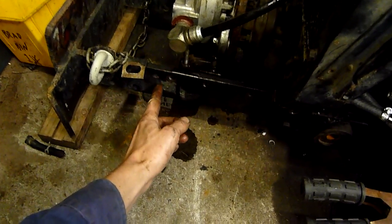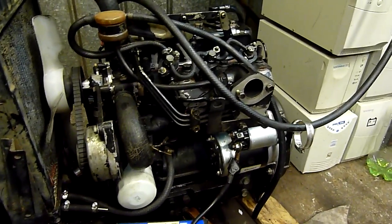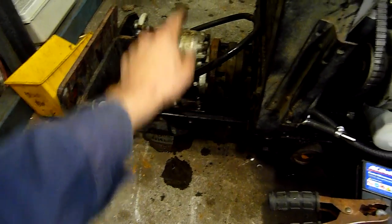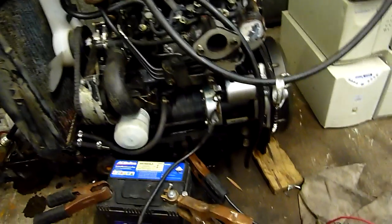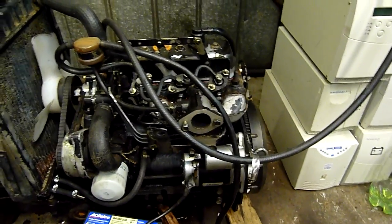So I'll probably end up cutting that off there, weld a cross brace across it, make some mounting feet, and mount the tank over the top. I'll have the hydraulic oil tank over the top, gravity feed to the intake for the pump, and high pressure output to a valve block. Should work quite well, as long as I've got minimum service area to get the rocker cover and all that sort of stuff off. I don't want to cover the engine up too much or obstruct the radiator.